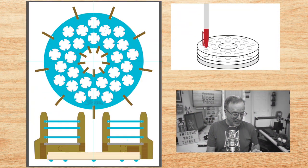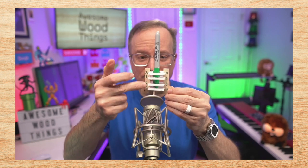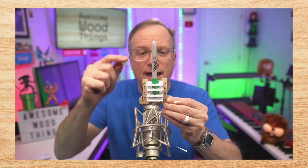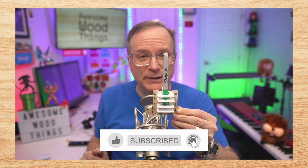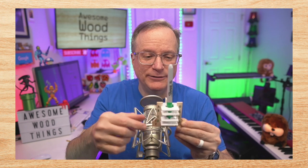Here's a quick refresher. This is the top-down view. This is the side view. I was holding these, and above is a crude animation of what this would look like. Here are the final carvings of the holes in the 4 different layers, and you'll notice there is a little bit of give. That's on purpose, because you can't expect people to pull this completely straight up in the air. People don't have the dexterity or control to do that repeatedly. So there has to be a little bit of give.